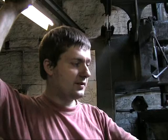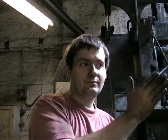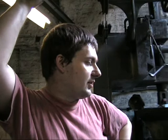Because this is the frequency that should be the same as the strike note, and it should be the same as the half nominal, but it can be out either way. And similarly, if the hum notes are very sharp, the bell starts to sound a bit watery. What a lovely expression, the hum notes.